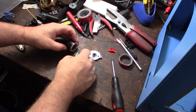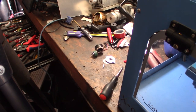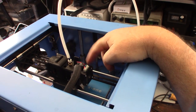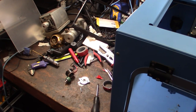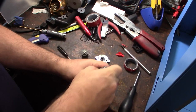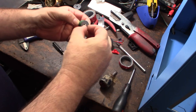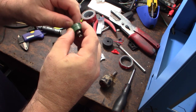Let me get my strong glass on. There are actually two NEMA 14 motor types, which is confusing if you're new. You have your NEMA 14 square motor, and then a NEMA 14 round motor — that's considered the 36 millimeter. I'm going to pop the bearing out of the back here. I can just feel the whole bearing is crunchy.